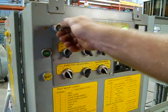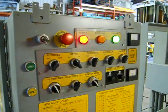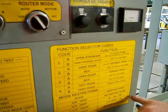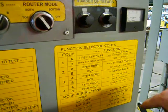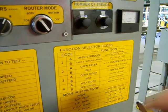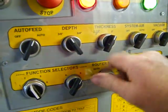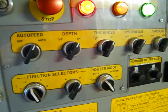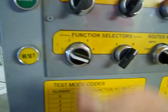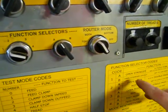To start out, we're going to go ahead and key it on. You're going to get your control light — turn it off, then press your e-start button so that's back on. If you look here, it's going to tell us 'open stringer.' The open stringer has some limitations: the depth has to be set to three-quarter deep, and the thickness has to be set to one and a half inch. These are your settings up here. We're going to set it to 1A, and that's going to give the PLC the code that knows we're doing open stringers.